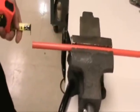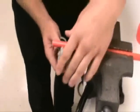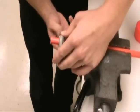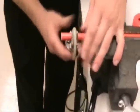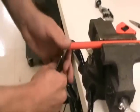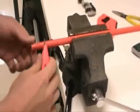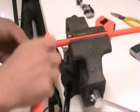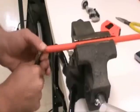I'm going to do this with a sharp knife, though I find it's a lot easier with a pipe cutter. You want to very carefully bite into the jacket a little at a time so you don't score the inner fiberglass rod. If you have to, you can go in with a sharp knife and gradually, very gradually, cut into that jacket. You want to avoid crushing or twisting the rod when you do this, and very gently move that jacket off.